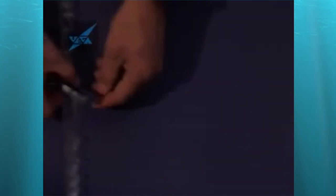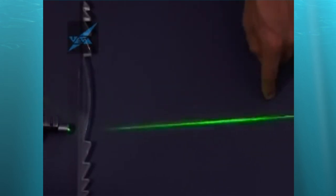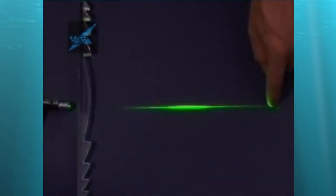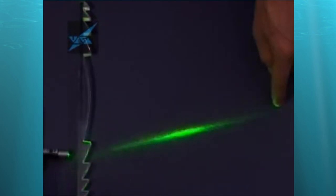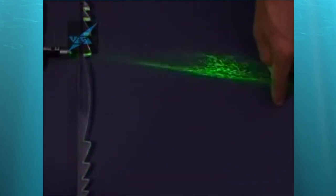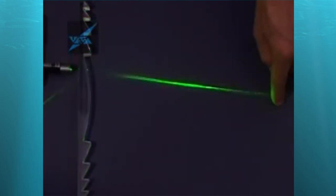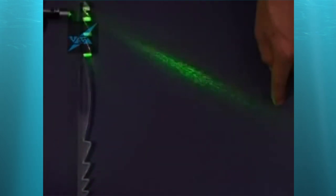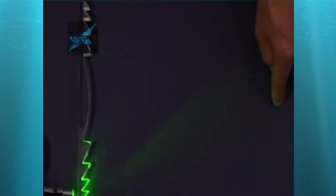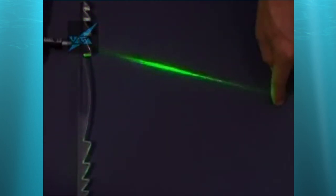Now we can swap this for the Fresnel lens. If this is working properly, it should produce exactly the same effect. If we fire the laser pointer through the middle, the rays go straight through. But at different angles, you can see that all the rays have been basically focused to the same point — the focus point — just like with the standard lens. There is some distortion when it goes into the next segment, so you wouldn't want to use these lenses in a camera because you'd end up with a distorted image. But if you just want to beam out a very strong beam of light from a lighthouse, the Fresnel lens is a very good approximation to the full-size lens. In fact, it's better, really, because it's so thin it absorbs far less light, giving a very nice bright beam.